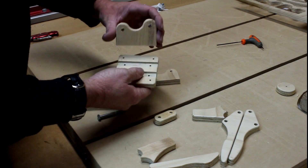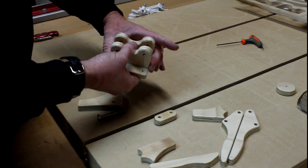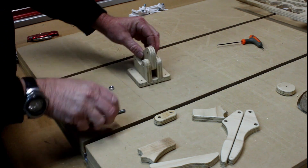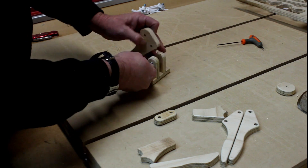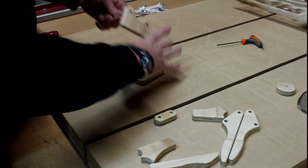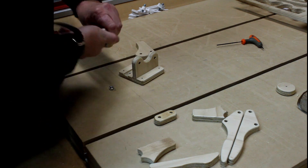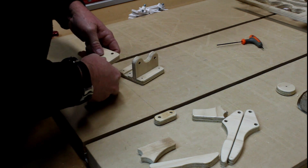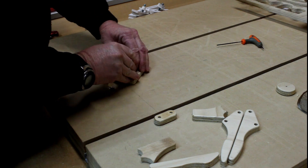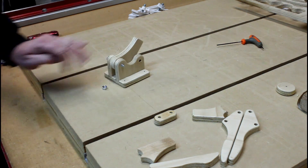I have here the base and it's going to take these two parts. If everything's cut correctly they should be a nice fit, but I need to make sure that they're correctly spaced when I do this. I'm just going to push my bolt through - they are a nice tight fit. Because what's going to happen is over time they're going to loosen up, so I want as tight a fit now as I can get. That's going to go in there, and I'll just grab some glue.